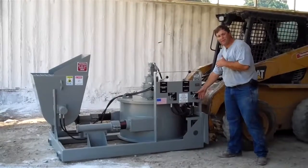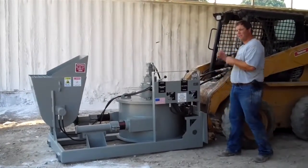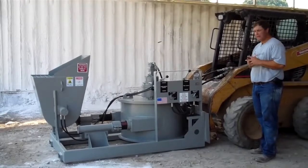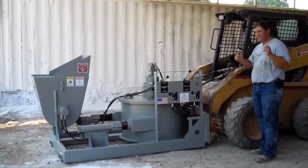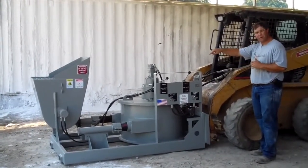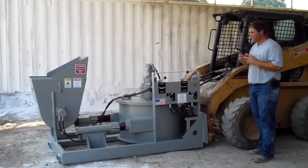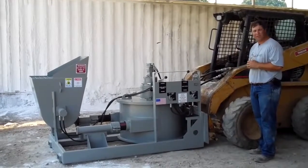We give the pump function hydraulic fluid. Then we get into the skid steer, crank the skid steer, engage the hydraulics. Make sure when you engage the auxiliary hydraulics that the pump head is rotating. If it does not rotate when you engage the auxiliary hydraulics, you're sending fluid to our attachment the wrong direction.